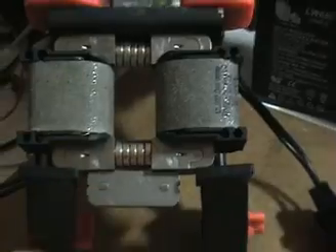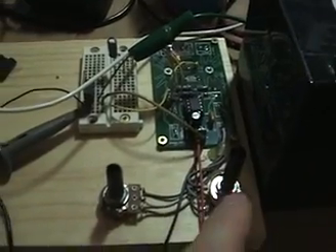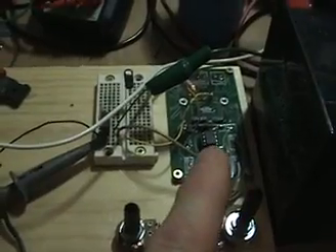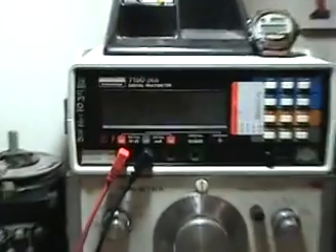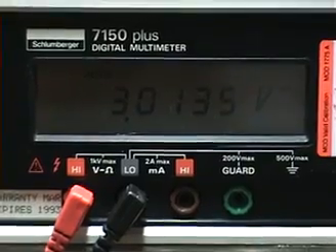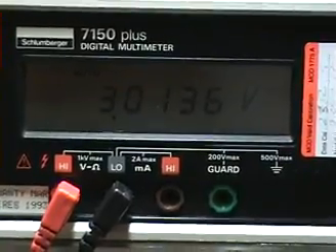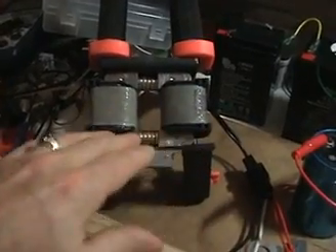I've attached my 555 circuit with adjustable duty cycle and frequency, set at a very low frequency. I'm still using this capacitor here, but I've charged it at a very low voltage — that 30,000 microfarad capacitor is charged exactly at 3 volts. And 3 volts is actually the ideal voltage to activate and deactivate the flux.